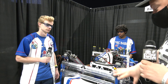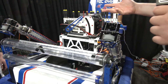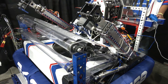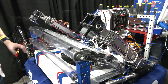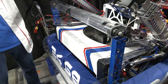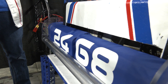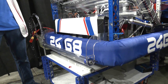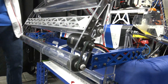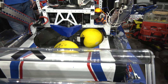So Andrew, to take us through the power cell cycle on this robot, we're going to start out with the intake. Tell me more about the material and why you went this route, maybe any iterations you had along the way. So this year we really wanted to focus on getting a wide intake — driver centric. To do that, we basically went as wide as possible within our frame perimeter. First we have our intake roller idler that stays out the whole match. This helps us with geometry to feed into the bot, and our intake is three and a half balls wide. Next we have our ramp. Last year we had a lot of issues with jamming and trying to funnel one wide, so we left all the way three wide for the ramp and then into the spindexer.